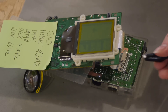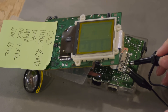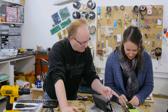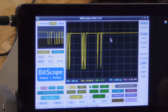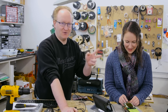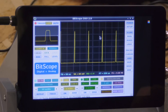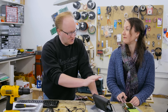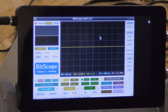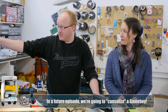Let's do an example. Hook up this alligator clip to that wire hanging off the Game Boy. I marked where the signals are. See the line where the V is? Hit that. We should see a 60 Hz signal. There it is — that's the vertical sync. Now go to the left and you'll find more signals. That's pixel data — so that's what's drawing the screen. Next one over is more pixel data — it's four shades of gray, so that's two bits, which is why there are two lines for data. And there should be one more which is horizontal sync — that's going to be at 15 kilohertz, which is actually the same speed they use for TV.